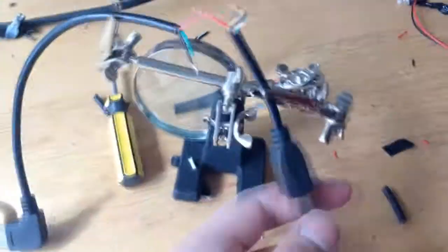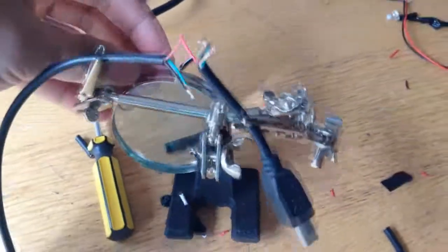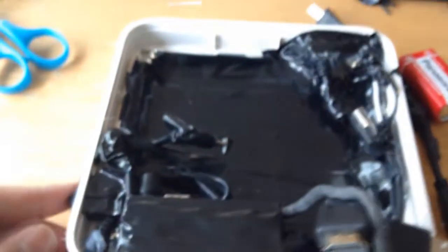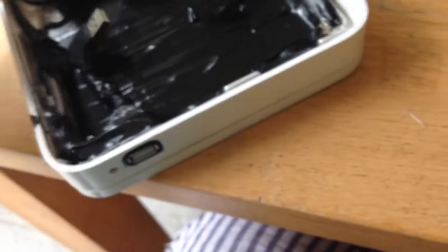I wired in all the things and put it all together. I split the power cables, and this is how I spliced the wires to make them shorter — and you do this to actually make the inline switch. They're just the wires; it looks a bit messy, but I did neaten them up by splicing them and electrical taping the parts that didn't look too great, and also to make sure the wires wouldn't short out by having contact with each other.